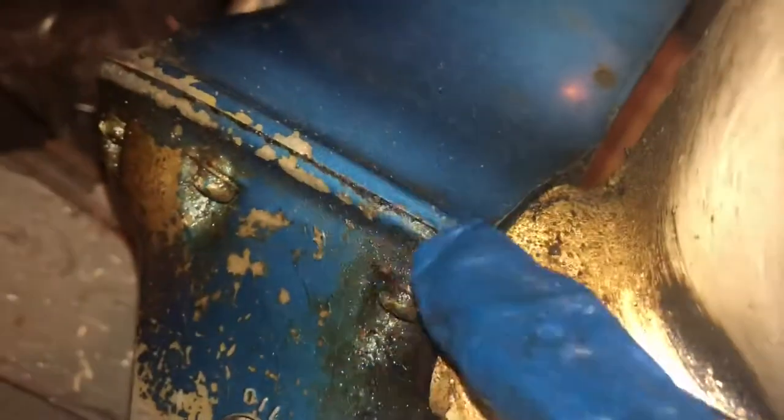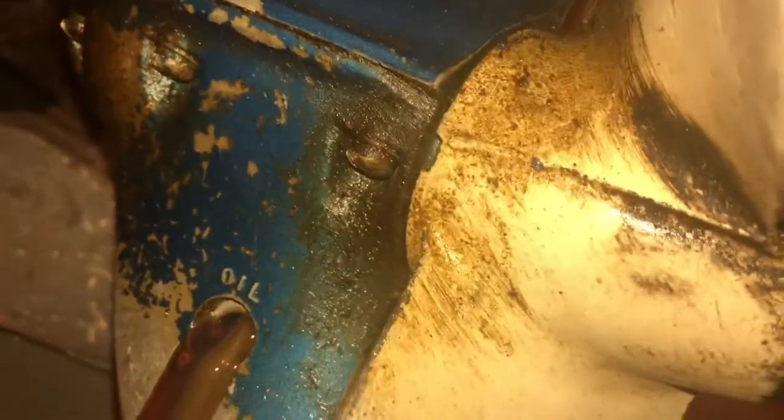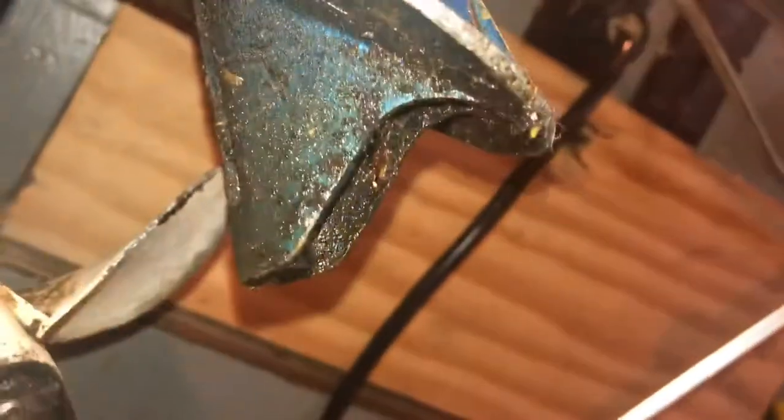It's saturated on the bottom there, so good chance this is the spaghetti seals. It doesn't look like it's lining up quite right — maybe they messed up the spaghetti seal, or they hit something like a rock. You can see the oil blowing out the back. So this will get a seal replace.